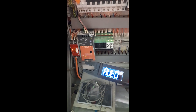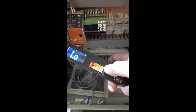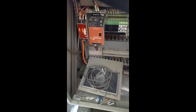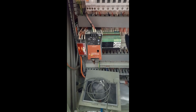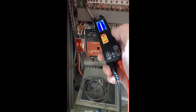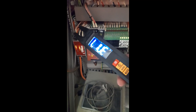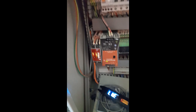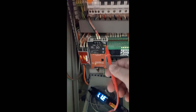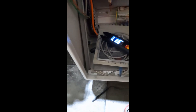In another board, using the bottom button on low it'll tell me if there's voltage, but only if the probes are all the way in. You can hear the beeping. Switching to high it's more sensitive, particularly on the left-hand tip. There's one more feature called live — if I take just the red wire and put it onto a live wire it beeps and shows high. So that feature does work.